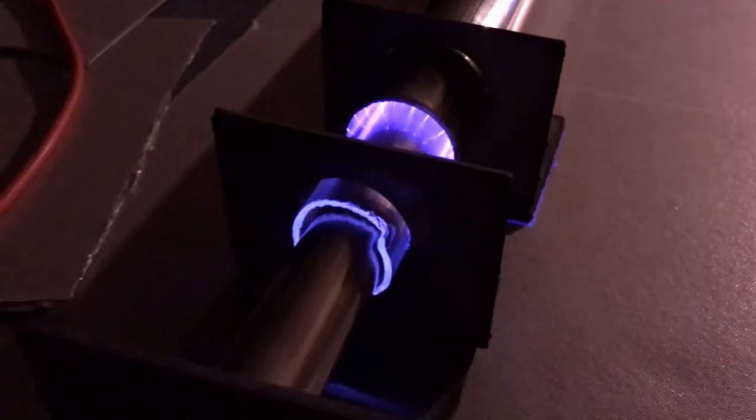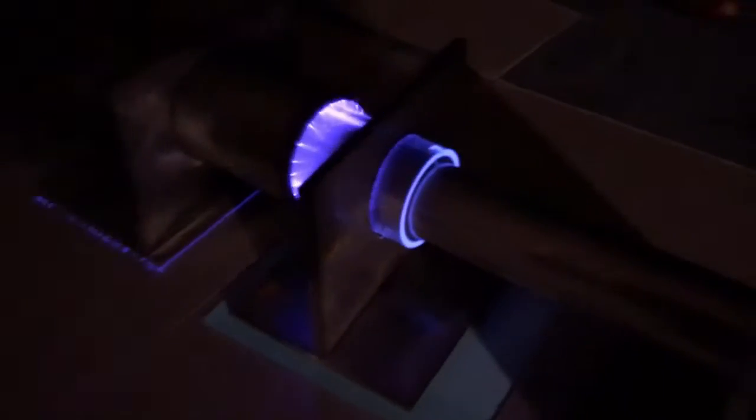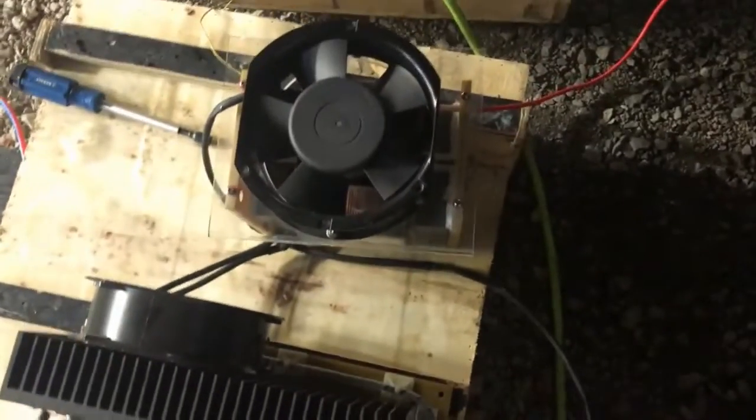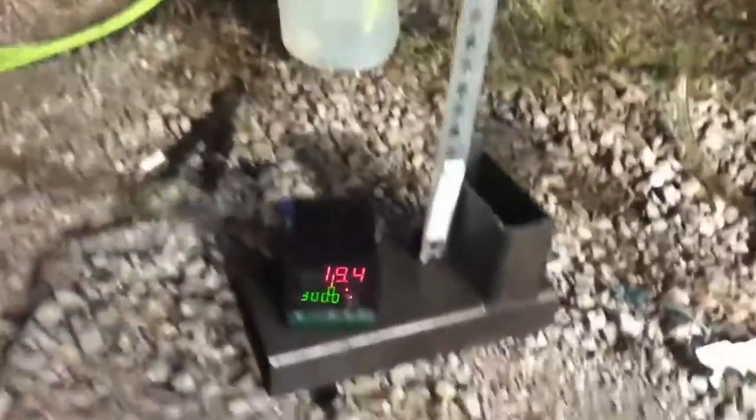In this test we're at about 6.7 amps, which is about 1.7 amps higher than what we're actually running on the test tonight. I just wanted you to see what's inside this machine. We have our oxygen concentrator running at 2 liters per minute, 95% oxygen, and the power supply is a 5 kilowatt, 10 to 14 kilovolts, 2 to 9 kilohertz unit. Here is our water discharge — we haven't started it up yet so the temperature hasn't heated up at all.